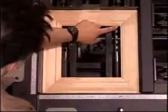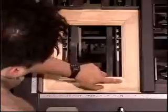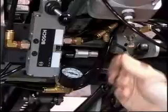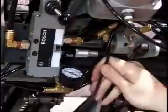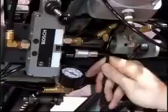If the factory setting does not allow you to make the desired adjustment, you may recalibrate the counter pressure to the manual pre-clamping setting. In the manual setting, the pressure on the main regulator remains at 52 psi; however, the pressure on the counter pressure regulator must be raised to 48 psi for a pressure differential of 4 psi.